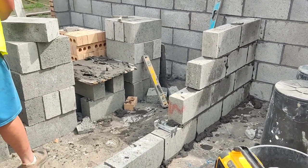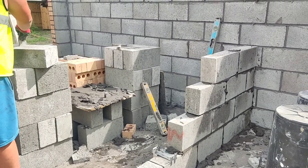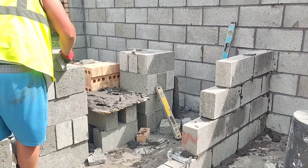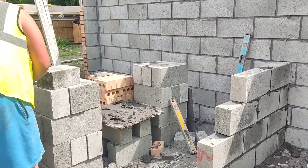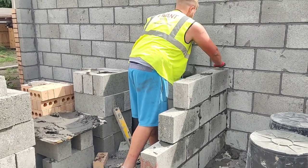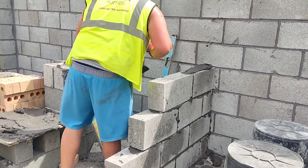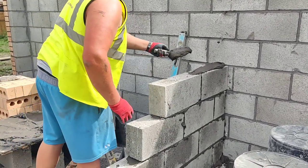But I've got a tub setup. Me and Dean tried it about 8 months ago when he first started working with me back in 2021. I'm revisiting working out of tubs because the mortar we're using on the other Gleeson site we're normally at dies straight away on the boards. It stays all right in the tub for a couple of hours, but on the boards you get it out and it's dead straight away.